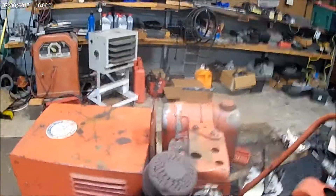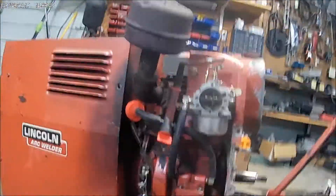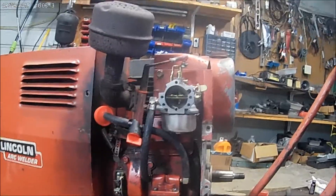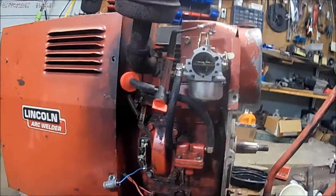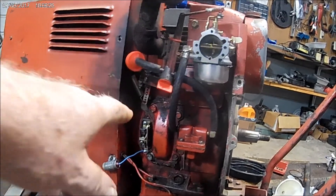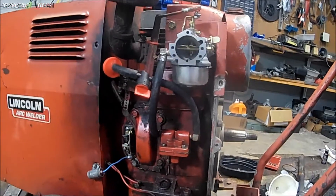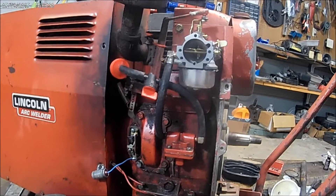There's this old monstrosity here. I thought I had it all rigged up with new rings and everything, and it might not have been bad rings — they did not look bad. But I couldn't get the thing to run at the time. I checked the fire and it's powered sometimes, but it didn't fire all the time — it's only intermittent. That's why it runs sometimes and didn't the other. When I had it turned over on the side or on the back, I got oil on these points. I thought, well, that's an easy fix. Well, I cleaned them all up, reset them and all that, and still no fire.